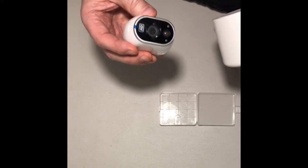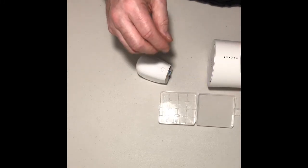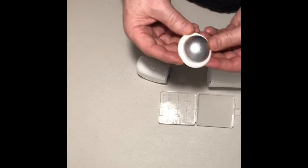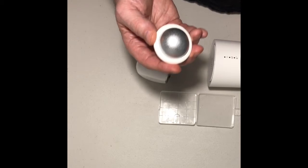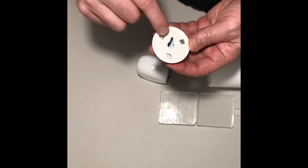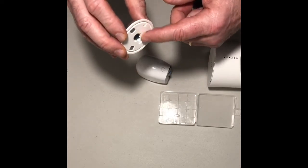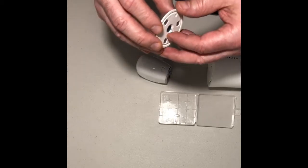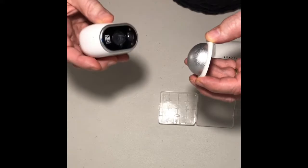Now the Arlo camera I'm using can be installed using 2 different mounts. The sample here is a wall mount. For this mount, I installed it on a garage port metal frame using a self-tapping screw. Then I just slid the mount over the screw. The camera has a strong magnet, and you attach it to the mount like this.